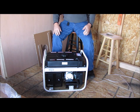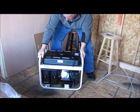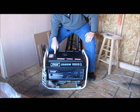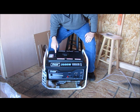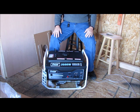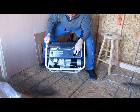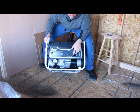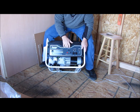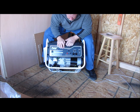Actually, you guys are looking at the back of it — you can see the engine sitting here. I'm assuming that this is the fuel tank up here on top. It's got a gauge right here that is going to show you when the tank is full or when it's getting empty. On the front, here are my two 120-volt outlets, 20 amps each, and they both have circuit breakers attached to them. This is my main AC breaker.